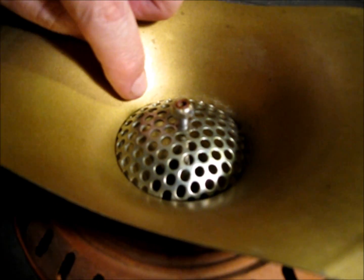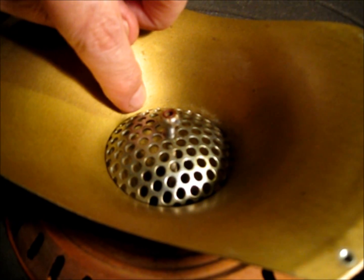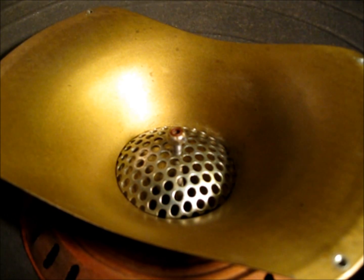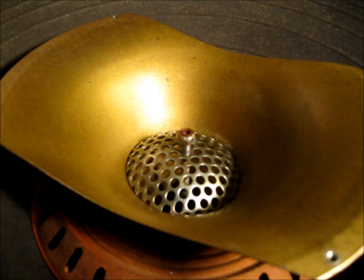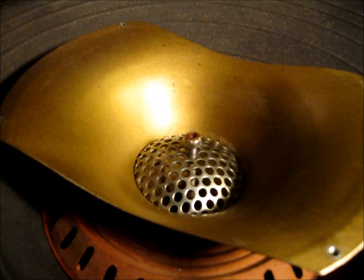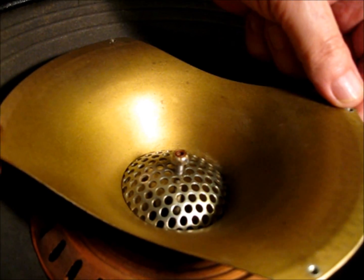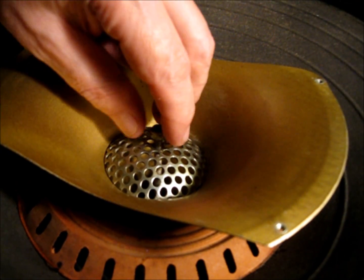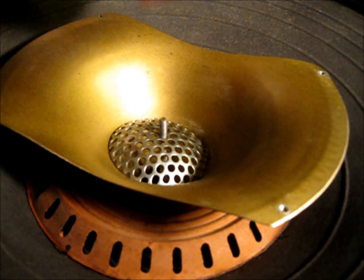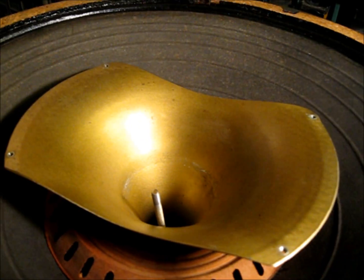That's metal to metal. And even with this nut tightened down, we've got probably 6 or 7K of metallic ringing buzz that's caused by a vibration between this guard and the horn flare, which is pretty thin. There's also another part that fits over here, a bracket which I don't have, that's designed to, or at least it helps to dampen some of this ringing out of this horn. So you pull the nut and you reach in here and get that piece off.